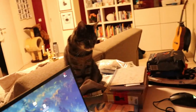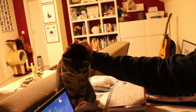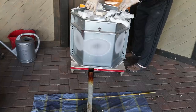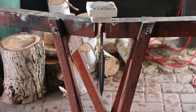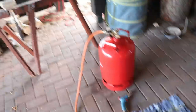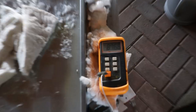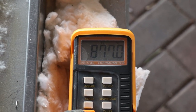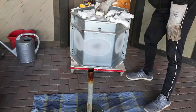It's half past five and I just got up to get some editing in before breakfast. Today I'm finally heat treating the blade. Since brass has a pretty low melting point, I use the pottery oven because that's the only thing where I can somewhat control the temperature. The brick that the knife is attached to fits perfectly into a slot on top of the oven, and now we're waiting for 880 degrees Celsius, then put it in for 10 minutes and quench it.